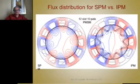Here's an interesting plot that shows the flux distribution using FEA analysis of a 10-pole 12-slot motor, which is a design that's been developed to get around a tough patent on a 12-slot 8-pole machine that's owned by Pabst in Germany. They've sued everybody and won every time, and this 10-pole 12-slot is a patent design-around. I first announced this in my first book in 1990, but there are some patents issued on it by the Japanese and the Americans, but they're not defensible because there's prior art described in my book. But you can see the difference in the flux paths from the IPM versus the surface mount. I think that's good for you to have in your mind.